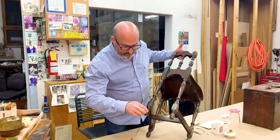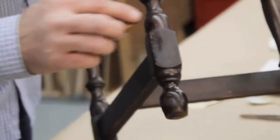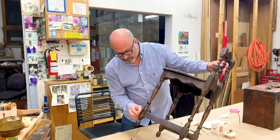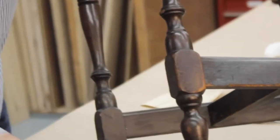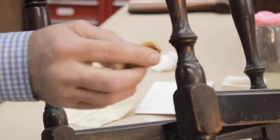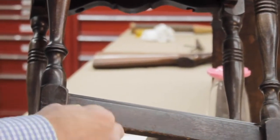I prefer using a pad over a brush because you can dab it into little gouges and then pad off the excess. It builds up against each other — different directions, soft, real soft. Once you get the color, then you put the clear coat over it. The color comes right into place; for a couple little gouges I squish it in and get it inside. Then I use a brush to dab into deeper areas, and everything going forward is going to be clear.